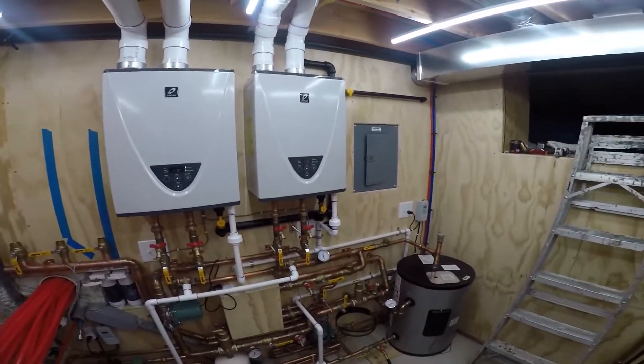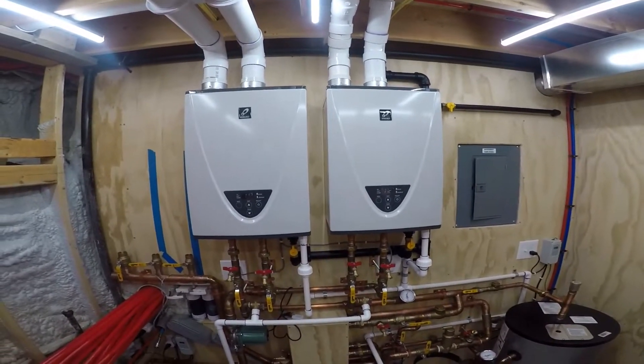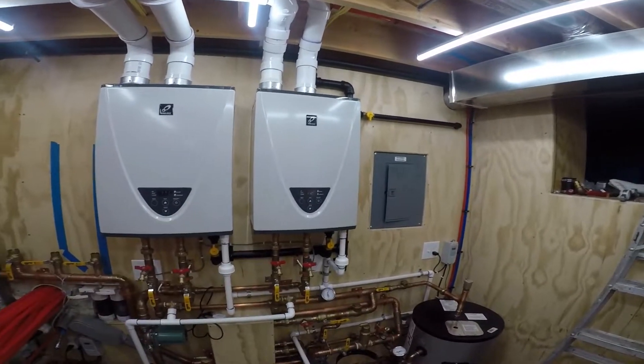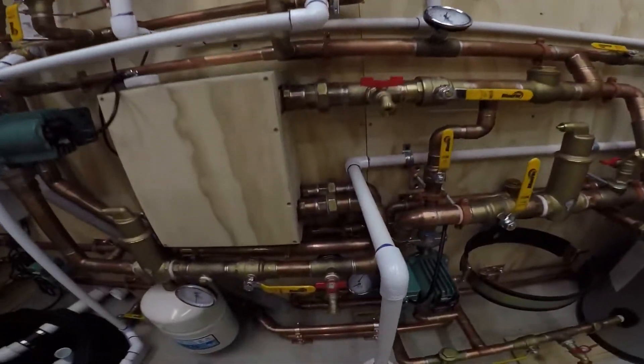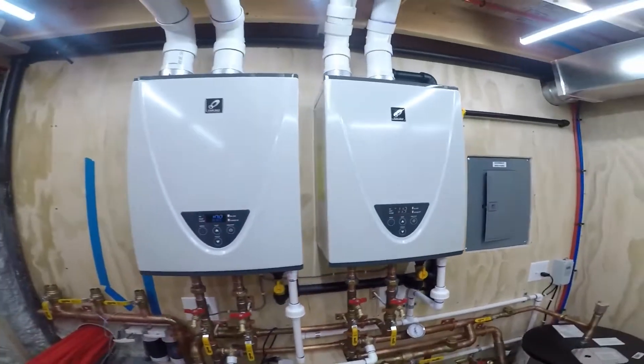What's interesting is that the tank is showing 127 and this is showing 112, because the incoming water — if you can see it down there — is only 58 degrees, it looks like.